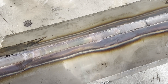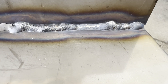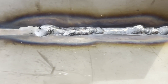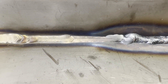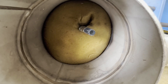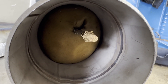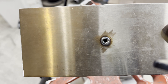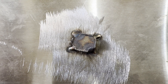Let me see the inside. Yes, as I expected, the first half is very bad. There could be many reasons for bad purging — pressure is too low, or the purging damper is too far from the joint. Another big reason is purge gas comes out straight and causes turbulence inside. I will show you two pictures: one without anything and the other with a copper muffler. The purging effect with a copper muffler is way, way better. So I decided to add a mesh plate on the hole — I expect the gas comes out like a spray mode and it will help.